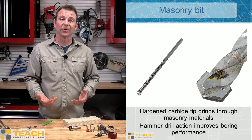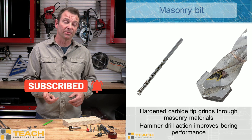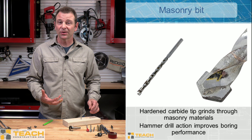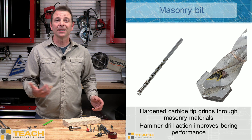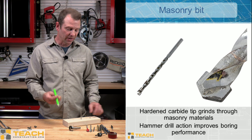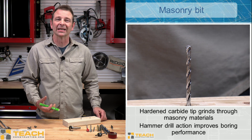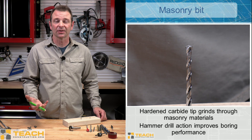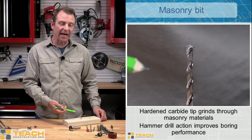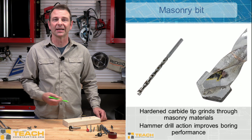You might need to drill through some masonry materials — that would be brick, concrete, concrete block. All of those materials need a special bit. None of the bits we've talked about so far will do that job. This is the one you would use — a masonry bit. A masonry bit does not really cut like your typical twist, paddle, or auger bits. It literally grinds the material away using a special carbide tip that has been welded or brazed on the end. This is going to basically just wear away the brick, masonry, or concrete until it gets through. It still has the same flutes to remove material and the same shank. That carbide tip is the critical part that makes it work in those really challenging materials.